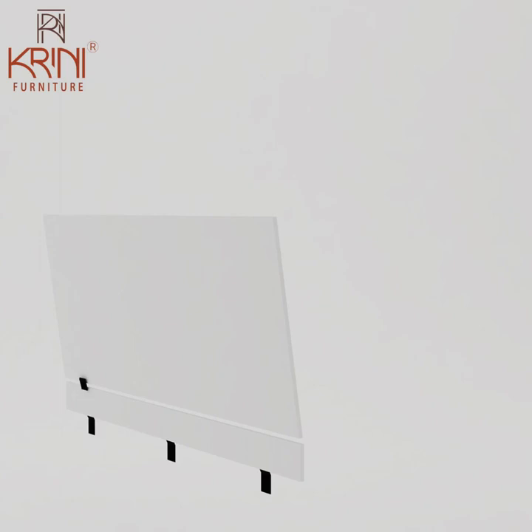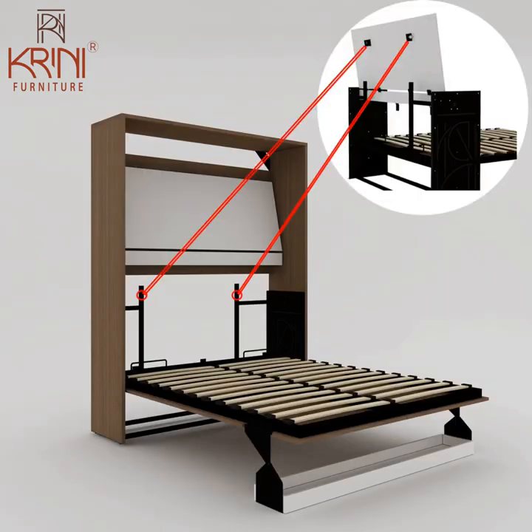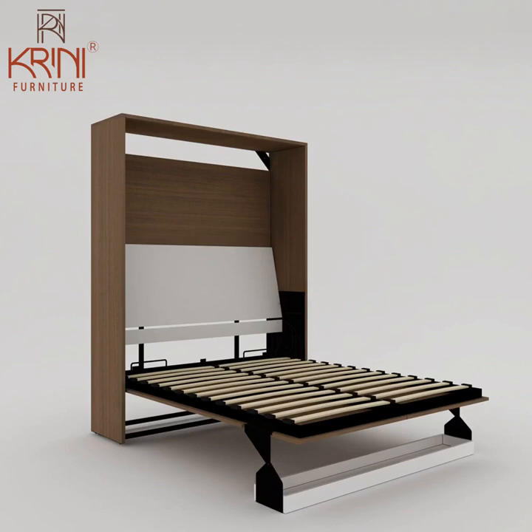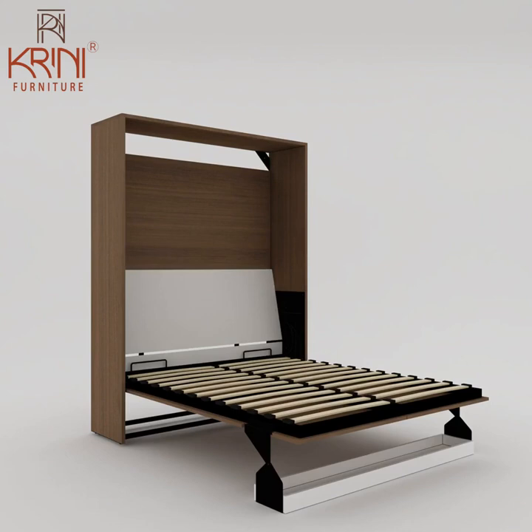Attach the Z brackets on the mattress frame with the headboard bottom panel, which in turn is attached with the upper headboard panel using full hinges. Fix two bearing wheels on the upper headboard panel for sliding the headboard into the two headboard runners. Before sliding the headboard, the upper horizontal pipe has to be removed and then put back after sliding.